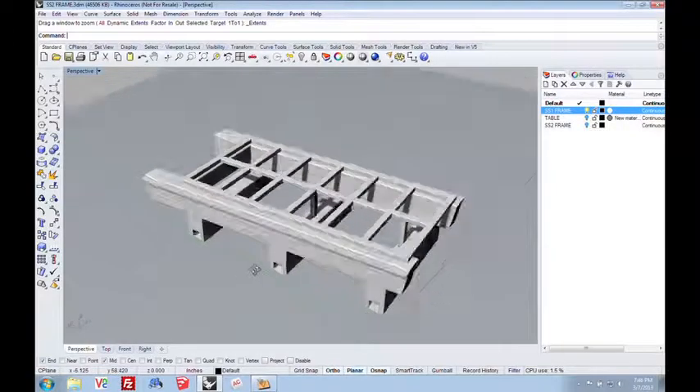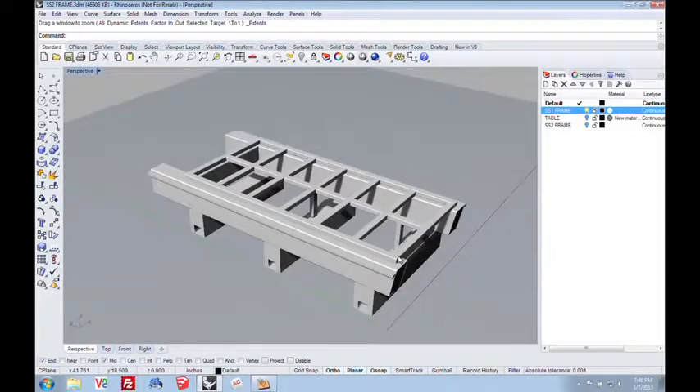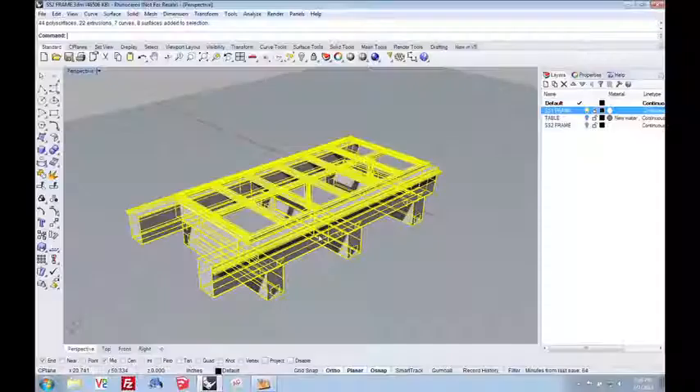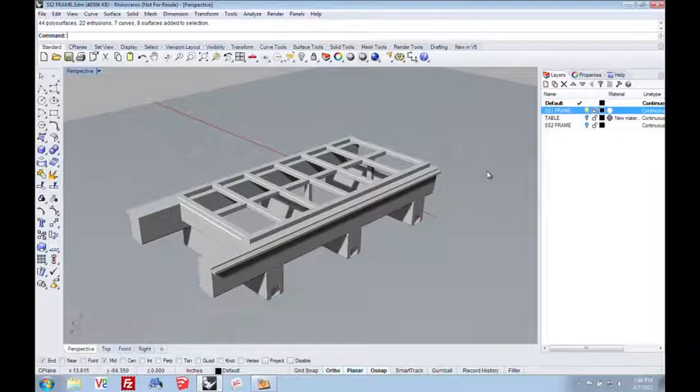It shares the same frame design as the Smart Shops, and we'll look at that in a little detail. This is the new design of the Smart Shop one frame. If you notice, it's very similar to the Smart Shop two, and here's why we did that. If you've watched some of our videos, you know that the Smart Shop machines create unbelievable edge finishes — straight edges, no chatter, high precision. The reason for that is real simple: this is a one piece frame. That's what makes it all work.